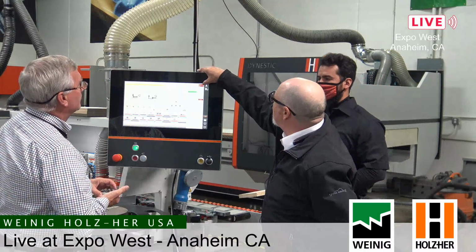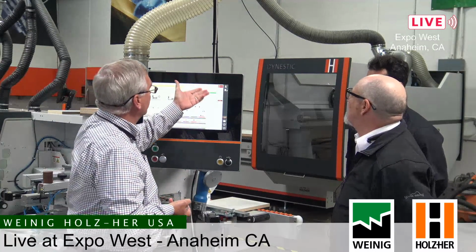So we're going to wait for the temperature to heat up because we've had the machine shut down. And here's your temperatures up here. Main heater, nozzle. From a cold start, we've mentioned this before, but if it's already been warmed up a little bit, it's 168, 175. Thermostat was set for 220. From room temperature, to get up to operating temperature is usually less than 3 minutes. Since we already were pretty warm, it'll be a pretty quick heat up.